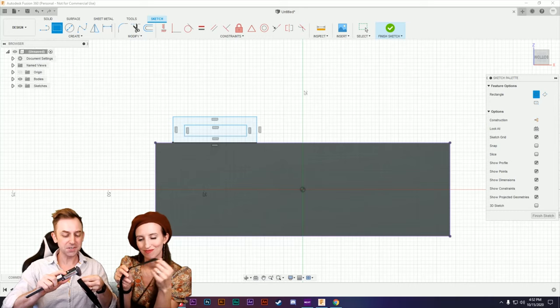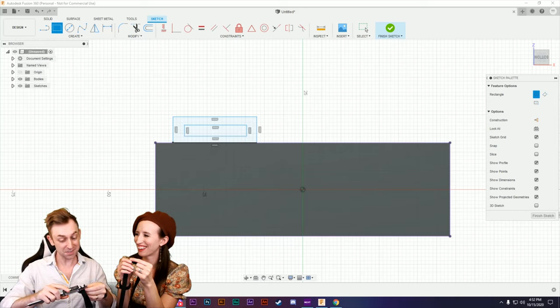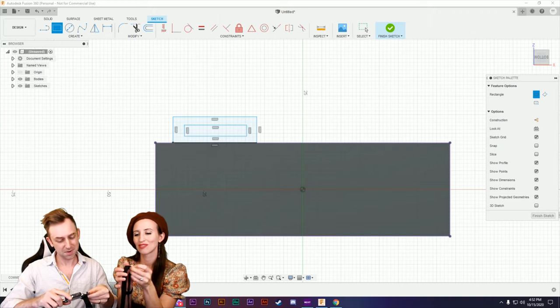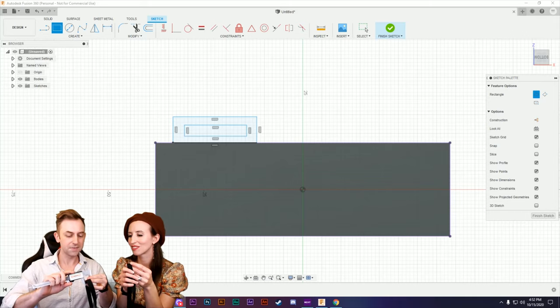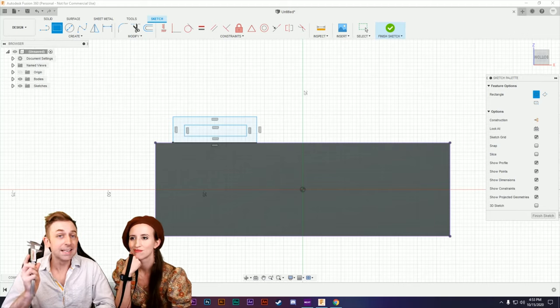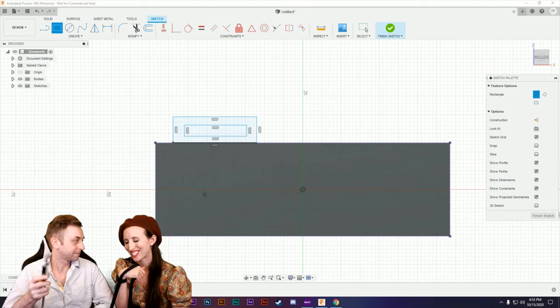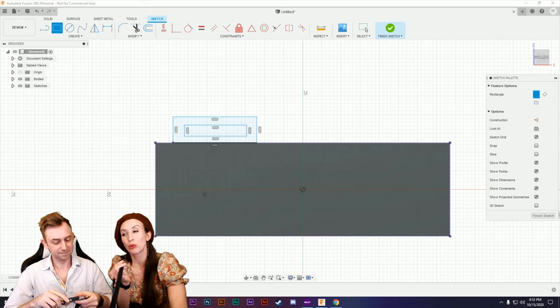So let's measure the nylon. It's a thumb's width. Oh, my goodness, it just about is. This is 18.9 millimeters. We'll round it up to 19, I bet, as the ideal nominal width. So that means the internal width needs to be bigger than 19, precisely, in order for it to move smoothly through.